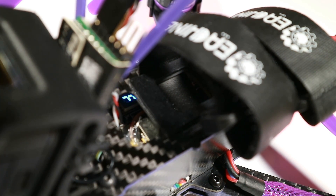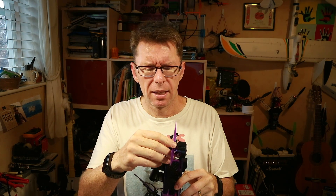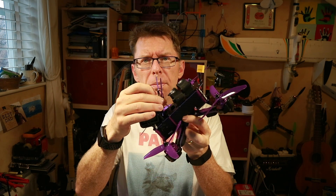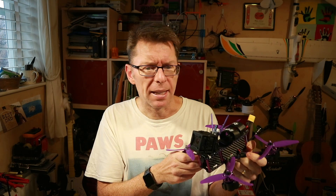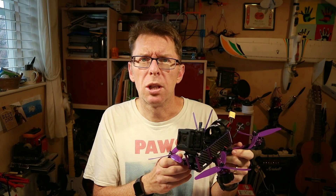So kind of one of three things fixed — yay, we can see what channel we're on now. I'll investigate this motor; I can't see anything rubbing on it and it feels pretty free, but it might point to the ESC so I'll look into that. I also haven't swapped the old X4R for an XM Plus, so that's on the to-do list as well. In terms of getting rid of the noise, I'll try putting an LC filter on there to see if that helps. I'll follow up when I've got the parts and more time to look at it properly, and we'll see you next time for part three.